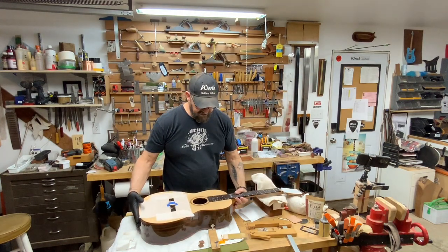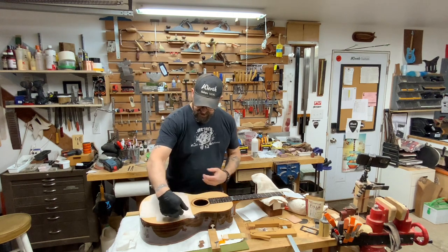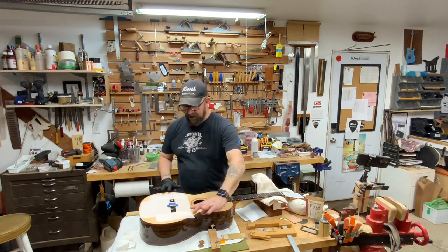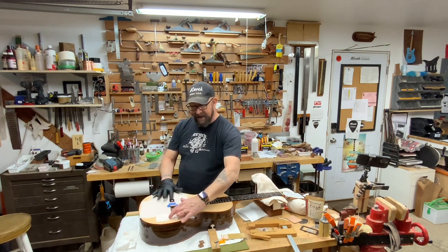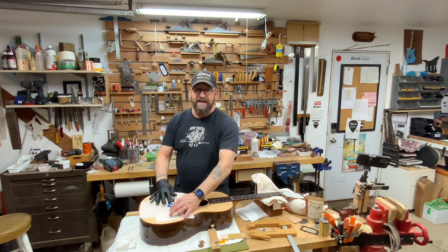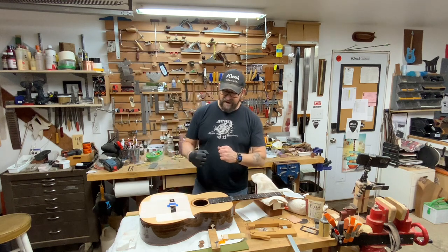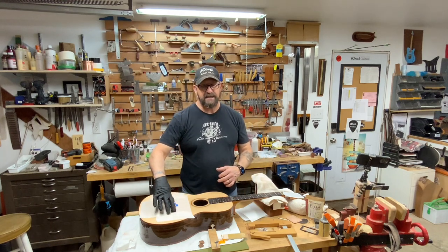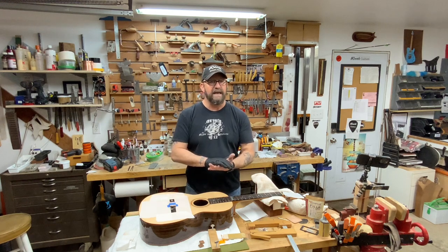So what I gotta do is clamp down in the middle and then kind of stick these going up the ramps, so to speak, on either side and gently clamp that down. Don't take a lot of pressure. It's a nice clean joint. They're both flat surfaces. I don't have to hog down on it real hard. All I have to do is just make sure that it stays in place and has a little bit of pressure against it to hold the two surfaces together.